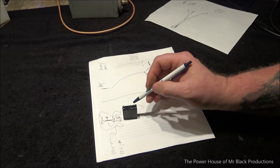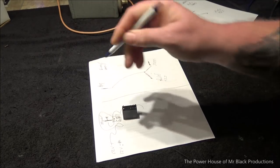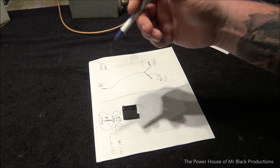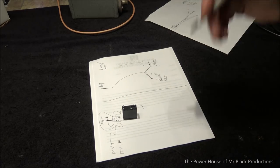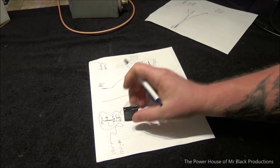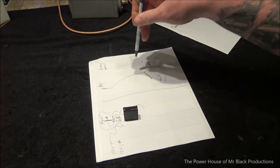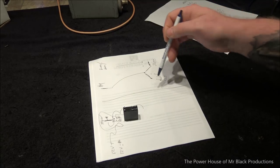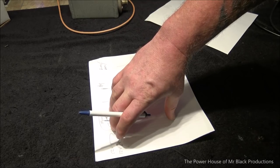In this first relay, we're going to short the center posts together, and we're going to bring them back and tie them to ground. The case of this Dow-Key is going to be ground. We're going to pick that current up, and we're going to use the case potential ground, which is omnipresent and universal, to drive everything and flip everything on and off. This first relay is going to drive our relays on this side of the universe and this side of the universe. We're literally going to put a wall down the middle of this metal enclosure that I've got. We're going to have the RF on one side, and the radios and all the controls for the radios on the other.